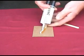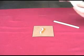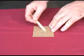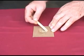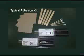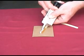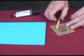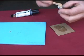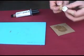When mixing two-part epoxies, it is important to follow the manufacturer's directions. Critical instructions include quantity of each part used, homogeneity after mixing, prevention of air bubbles, and staying within the working life. Kits include all the equipment required for mixing. A single plunger application tube is used to provide equal parts of epoxy and hardener. A uniform coating of adhesive should be added to the surface of the dolly. When placing the dolly on the surface, it is important to push straight down to squeeze out excess adhesive.